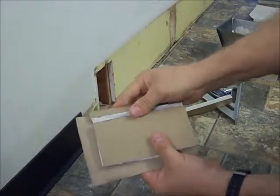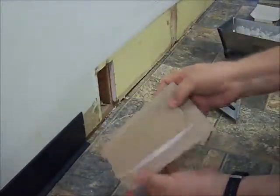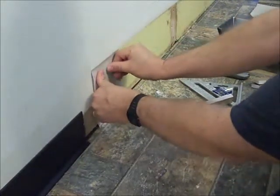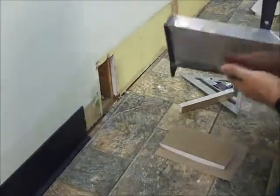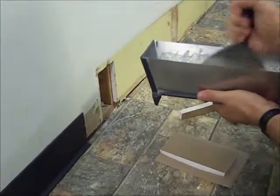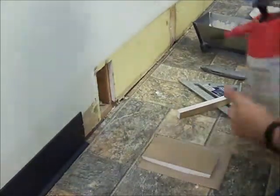Do it here also. And now I've got the perfect patch, which I had pre-measured. Let's see if it fits — yep, that one will fit perfectly. I'm going to go ahead and spackle it in place. I'm using the setting type of spackle, which I've already mixed up. This is a 20-minute set. I actually prefer using this because it gives you a tighter, stronger patch than if you were to use something else.